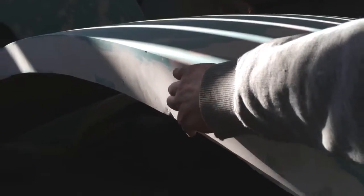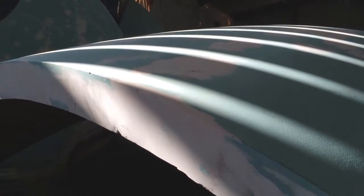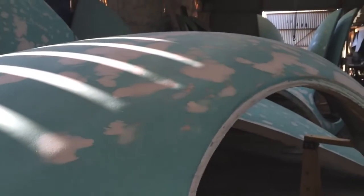As you move around the pieces and you think they're all finished, there are still little bits of snagging that you notice, little bits that need to be filled, even if they're going to be invisible to the eye once this Futuro is constructed. Here we have a flange edge that really just needs a little bit of filling, just to make that line nice and sharp again. As I say, it'll be covered over when the house is constructed, but really it's just about giving each piece back its integrity, making sure it's as close to as it was in form when it came out of the factory.